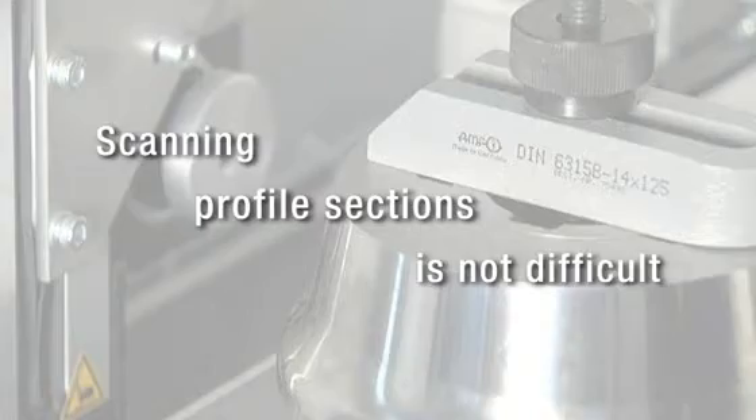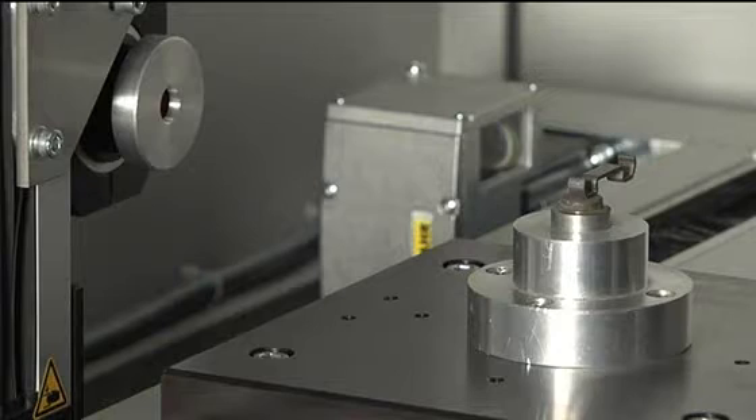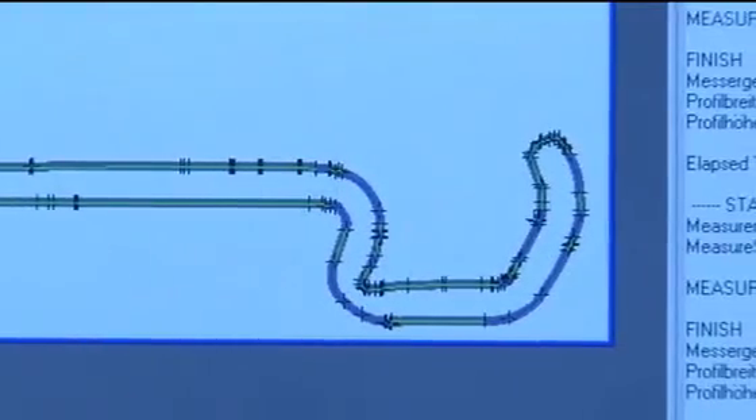Scanning profile sections is not difficult. Scanning profile cross-sections is as easy as scanning rolls — you just put a part of the section into the scanner and scan it. You can use this information not only to make sure the geometry of the final part is what it should be within specific tolerances, but also to check for specific problems that can influence your design. For example, you can check if there is a specific spring back, whether the radius is formed well, if there are any abnormal anomalies, whether all lengths are correct, and you will also see the necking in the bends — meaning the specific thinning of the material in the bend areas — and whether this is still within acceptable limits.